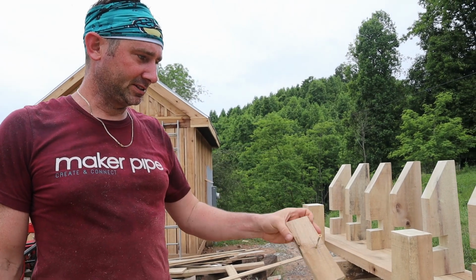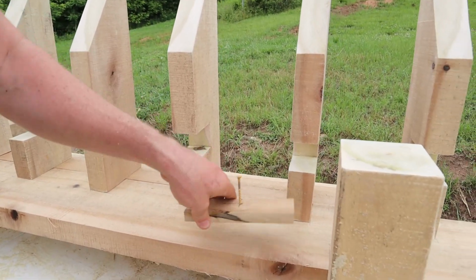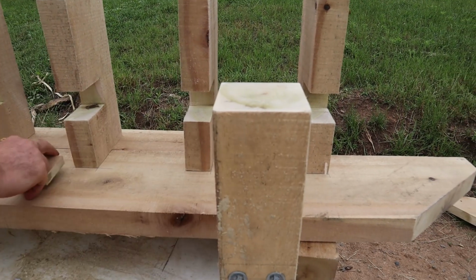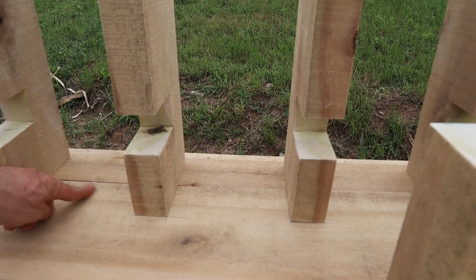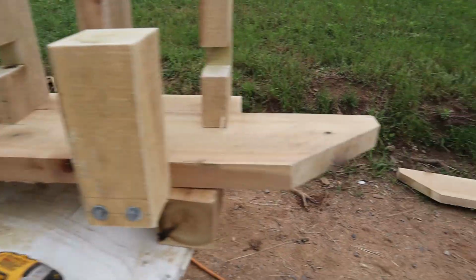Instead of getting a tape measure awkwardly between these two pergies, I'm just using this jig, and I get it between. It's kind of a tight fit though. I should have shaved it a little bit more. Anyway, you get it between, line it up on that top line here, and then just zip it in with that a little bit. Now I got a nice center mark. Nice. And that's where I'm going to put my bolts. John likes to make jigs. So we do that.